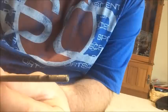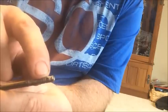I'm going to take my new gas block and we're going to go ahead and slide the gas tube in. Note: there are two holes in the gas tube. The larger of the two only goes into the tube itself — it doesn't go all the way through. The little one on the end is for the roll pin, to hold it securely in place.